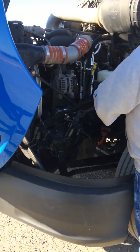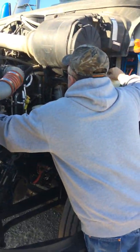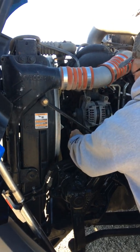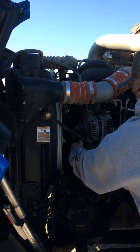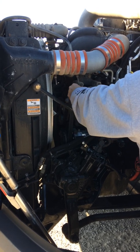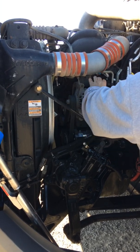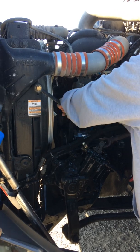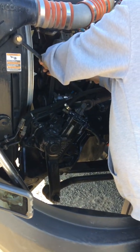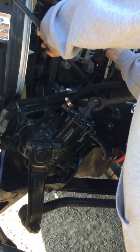Now I'm going to talk about my alternator. My alternator is belt-driven — no more than a half to three-quarter inch of play, not worn, torn, or frayed. No loose or missing bolts; it's secure and tight. I don't have any bare, loose, or frayed wires. They're secure and tight and they're not taped.